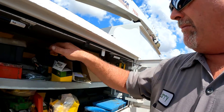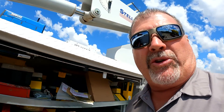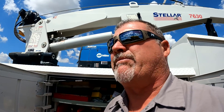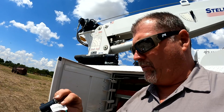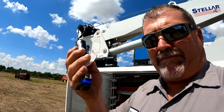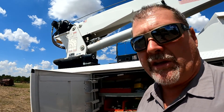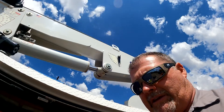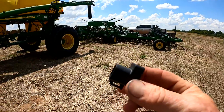Here is the jumper harness we're going to use to eliminate the blockage on the tool. This is a quick way to eliminate blockage being a problem on your communication — just install this little jumper with a CAN bus terminator. This is an RE 230232. We're going to plug that in and plug in a terminator on this end. The terminator here is an RE 207311 — that's your CAN terminator.